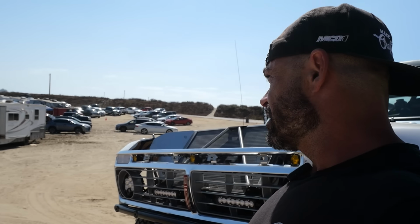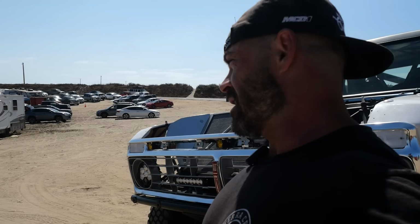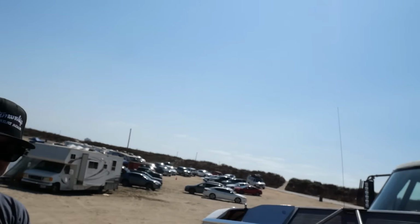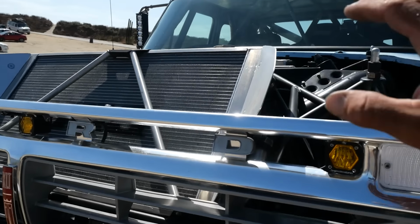And this thing was a Tundra rear mount radiator. It was having problems. I think it was because it worked for an LS1 or an LS3, and then when you put the big 454 in there, it was hot. And when it got hot, it wouldn't get better, and we just couldn't fix it. And I'm a Glamis guy, right? So that's a sand bog, it just puts a lot, like 20% more load of all-time power. 100%. So we opted for a bigger radiator, put it up front.